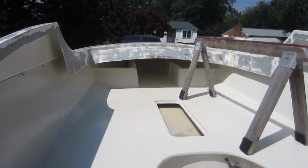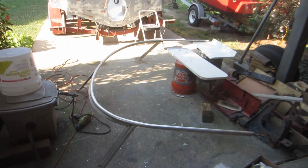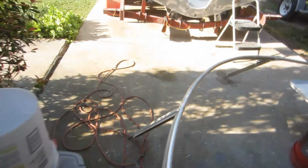Okay, back to drilling. Well, as you can see, we did some work to the windshield to get it ready for an install test. We got our studs. We actually JB welded those up into a cavity. We can actually look at this one here. And went ahead and pinned them from inside the track here with a screw, so they are not going to turn or go out ever without tearing the whole bottom of the thing off.